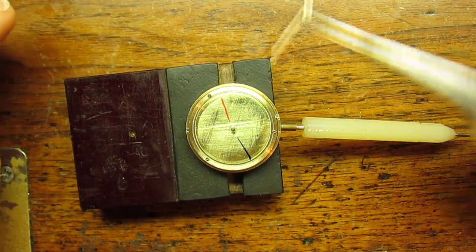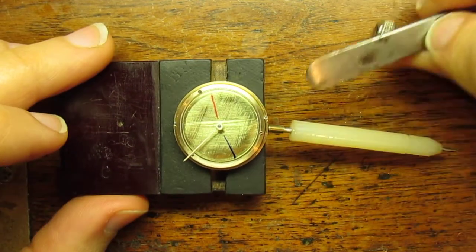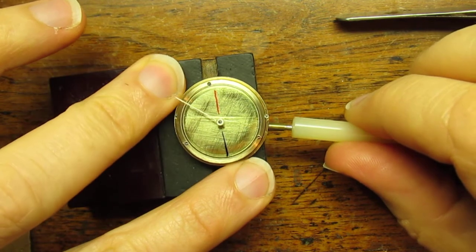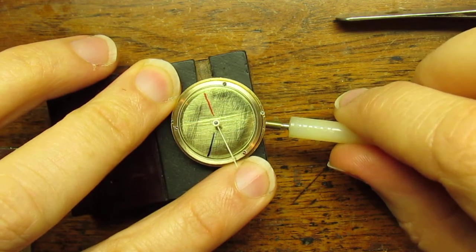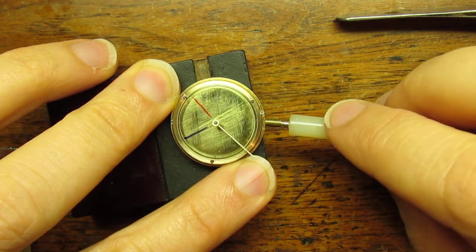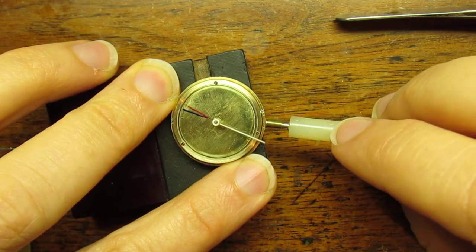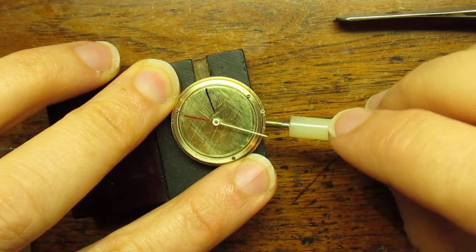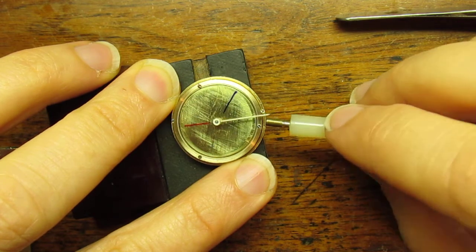Those three screws are holding almost everything together, and I've put on a generic minute hand so you can see the motion of things. You can see the clouds going in a clockwise manner, and then one jump an hour you'll see the sky disk go one-nineteenth of a turn. I would have loved to gear that instead of doing the star wheel, but it just wasn't practical. So there you go — that's the function, that's how it's going to look.